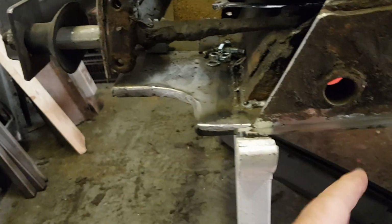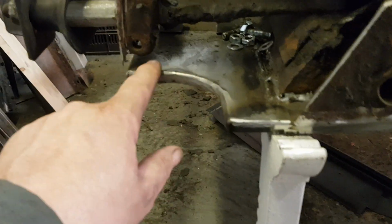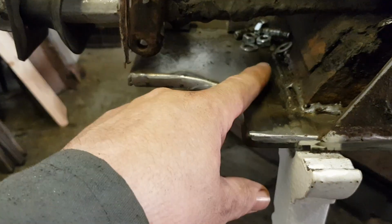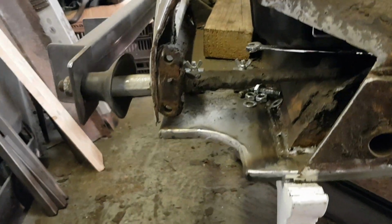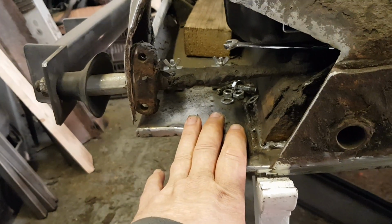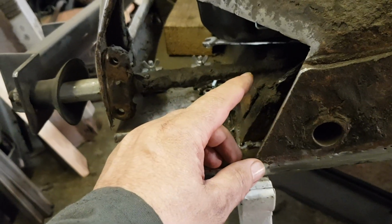But as I say, this is the original mounting, which I've repaired along here, and then I've made this corner up, which runs across to the bottom of the boot floor. Made it good. It just wants a little bit of welding there, where you can see the clips, just to marry it up with the other floor panel. So this was where I started, and then I cut this panel out because it had a big hole in behind this tie down strap.